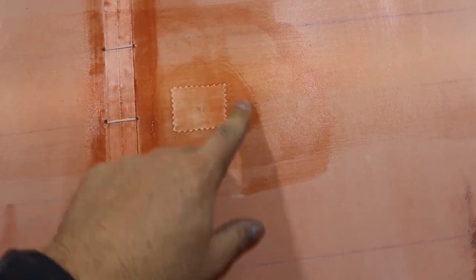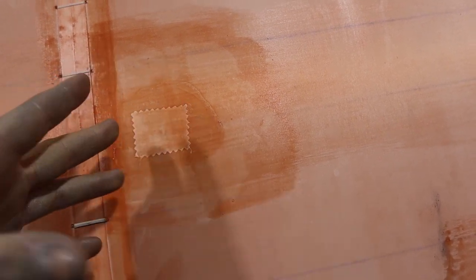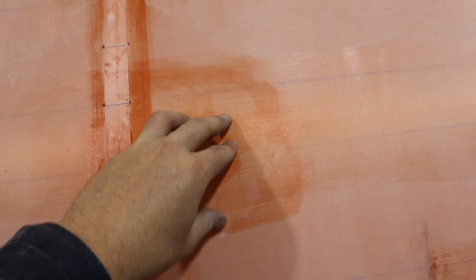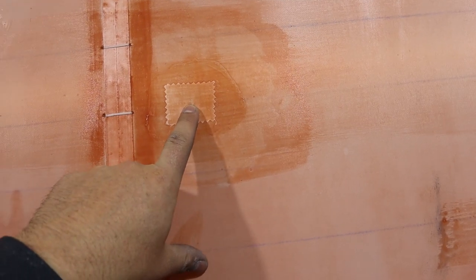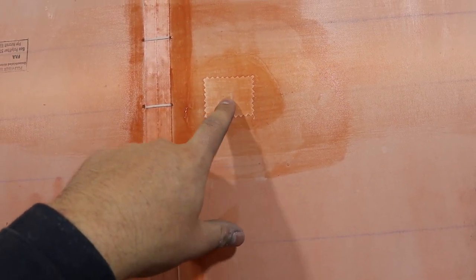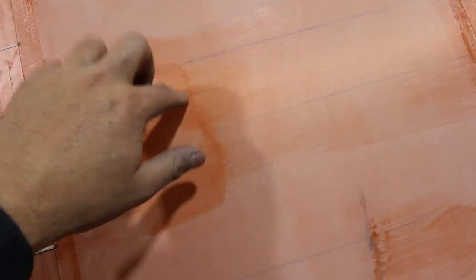To patch, you paint Polytac on, throw a patch on, and if it's big enough you can shrink the fabric back together using the Polytac patch as a pulling surface. Knowing now — I just talked to Polyfiber about this — if it's under three-eighths of an inch you could just put a finish tape over it. There's actually a finish tape going over this area for the spar anyway, so I would have been fine, but it's got an extra patch on there just for good measure.